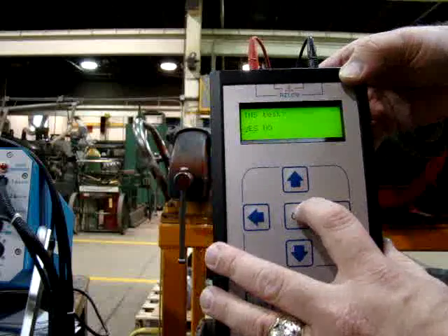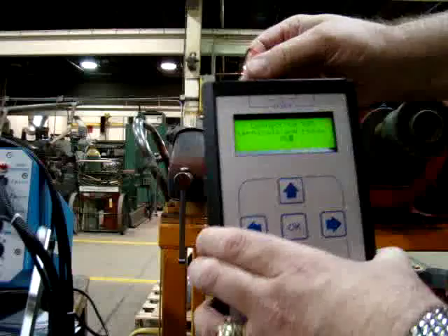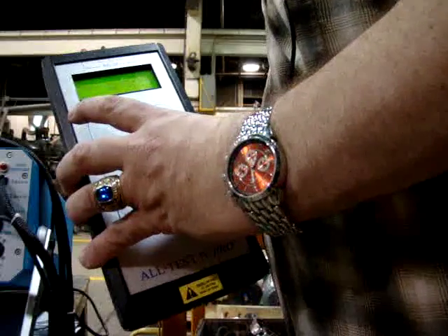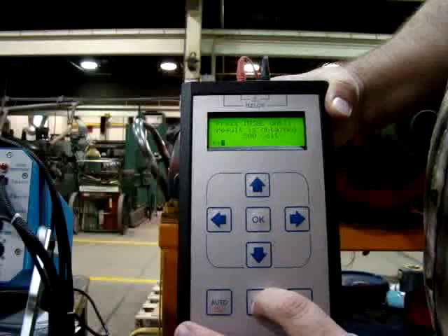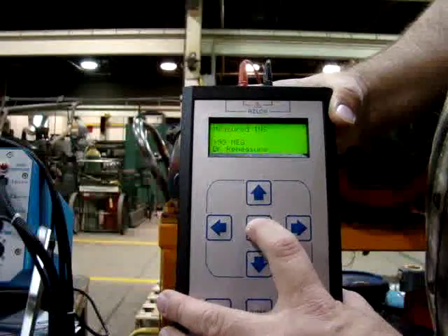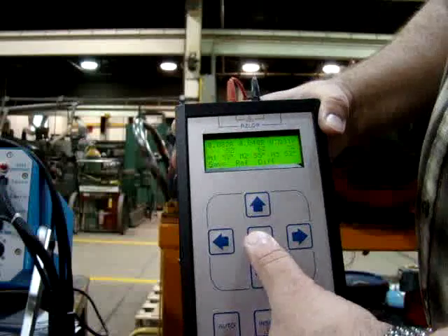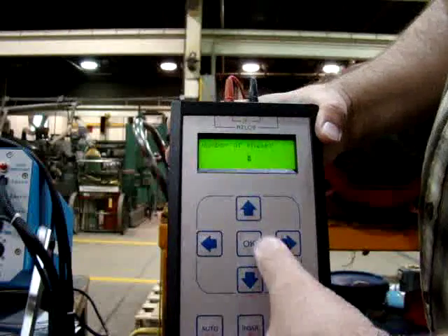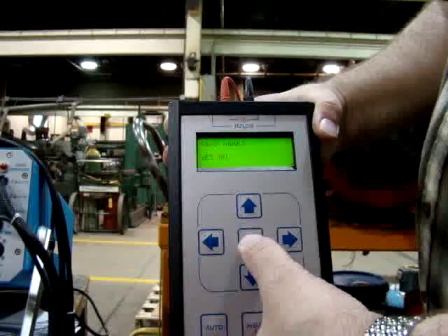It's okay. Do an insulation and ground test — yes, we will. Change the lead position, press in, press okay. Connect to ground, press hold to lead. Greater than 100 meg ohms. Press okay — we can save our data. A, B, C phase. Save it. Yes.